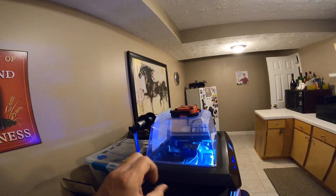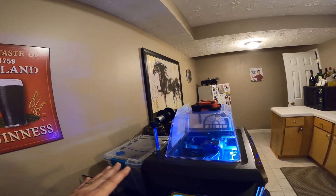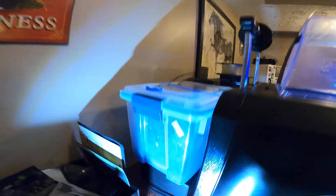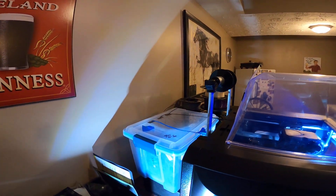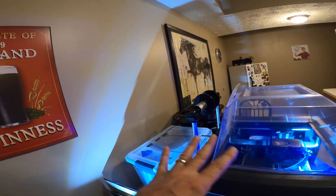If you don't dry it, first thing you'll see when you put your nylon on is it start spitting and you'll see steam coming out — that's because there's moisture in it. Nylon is hydroscopic and very hydroscopic; I've left a roll of filament out sitting overnight and it'll absorb moisture. So dry it out in an oven, then get yourself a dry box — there are videos out there on how to make one. Get some blue silica gel; when it absorbs too much moisture it turns pink, telling you it's saturated. You can put the silica gel back in the oven for a couple hours and it'll turn blue again. I keep my TPU, nylon, and nylon carbon fiber in an enclosed box with holes drilled through it to run the filament, keeping moisture out while I'm printing.